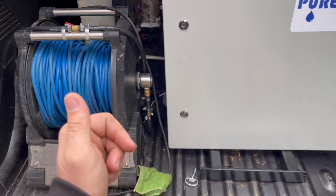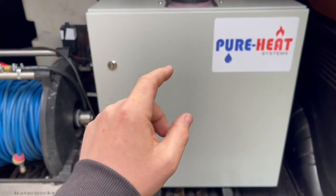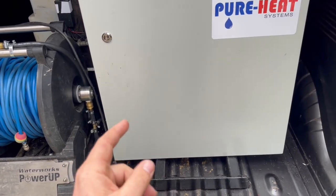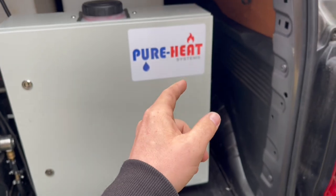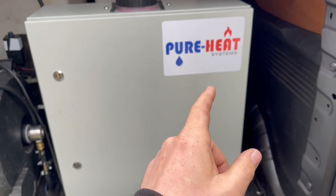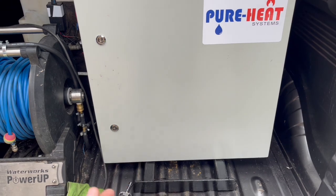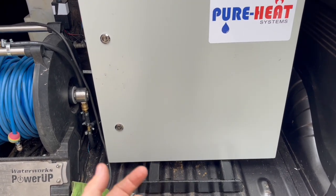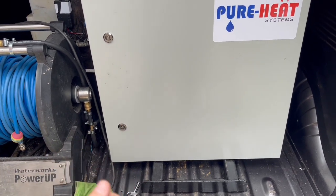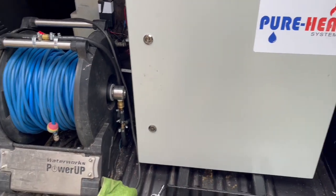That's the one problem. Problem number two is, as soon as this unit goes below 60 degrees in the coolant loop, it's then going to boot back up again. And this is going to be happening all day long. So each time it does a startup cycle, it's pulling a lot of current from the battery, because it's only on the initial startup that the batteries take a hit from the heater. And not only that, constant stop starting of anything diesel like that wrecks components. Just think of it as a DPF filter. If you're doing short journeys and you're constantly stop starting a vehicle and not getting it up to temperature, you're going to clog up the DPF. It's exactly the same for the heater. So we like to keep that burner running continuously.